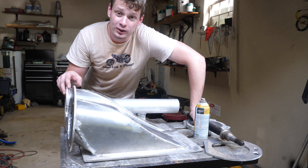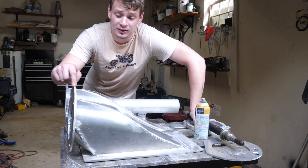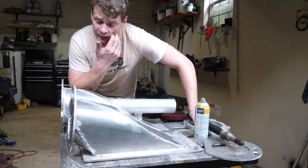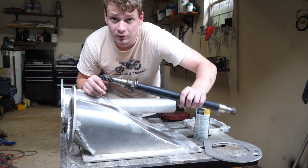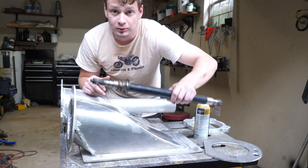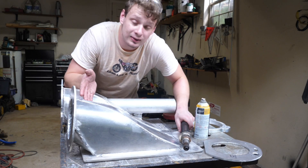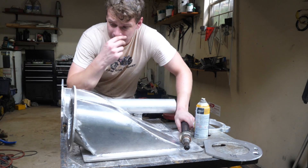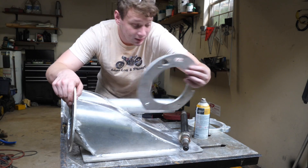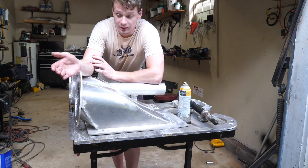Everything was going good until I realized I screwed up. This end flange right here — I angled it too much upwards. If you compare it to this one, this one is basically at 90 degrees. What that would mean is we'd have issues with our driveshaft alignment — instead of sitting like this, it would sit like this. That would probably cause issues down the line. The perfectionist in me wants to cut this flange off, so I cut a new one and we're going to fix this. We'll just have to see how much material we have there to weld.